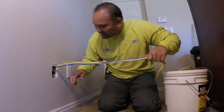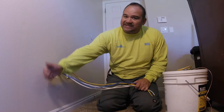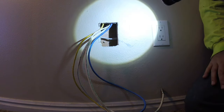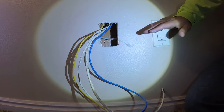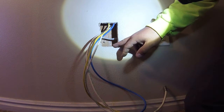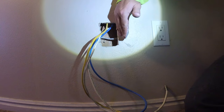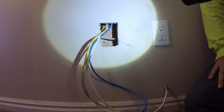When I wired my house I wired stuff everywhere, so I have a bunch of wires here. If you're subscribers you'll remember that in an earlier video we took this electrical outlet, went sideways then up the wall and put a new outlet behind the TV. I'm going to use this existing hole and try to go down through the wall. Inside this hole - this white wire going this way is the wire off that outlet we ran for the TV. What's a little odd about my wall is I have a 2x4 in the back turned sideways, so this hole is a little shallow, but we're going to use that to our advantage.